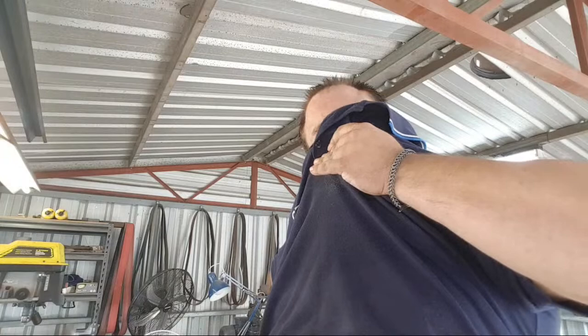The things they're not good at is working small material, and working anything that requires it to sit inside the forge. Like hammer billets, you can't put a hammer billet in there because it'll just drop to the bottom of the forge.